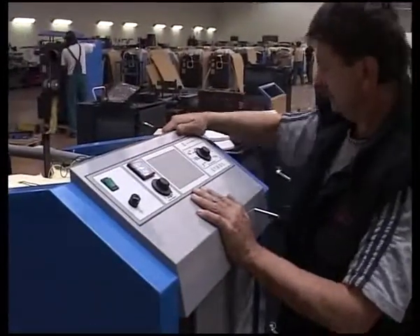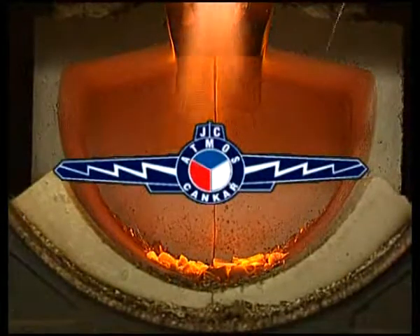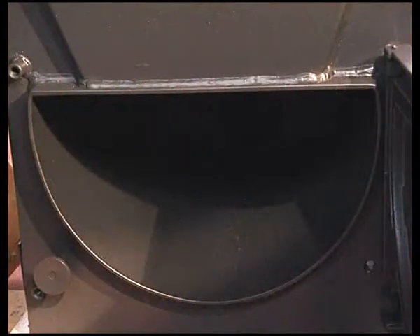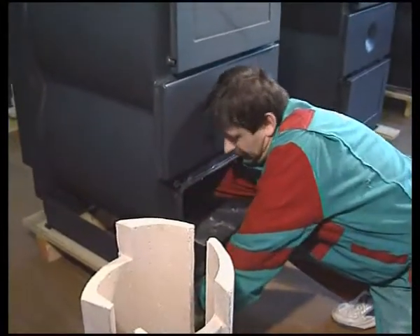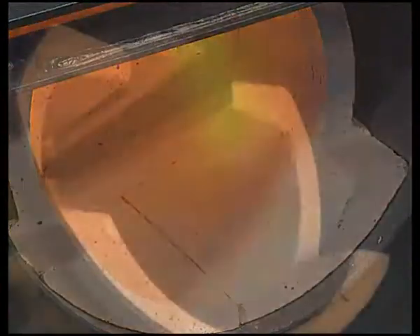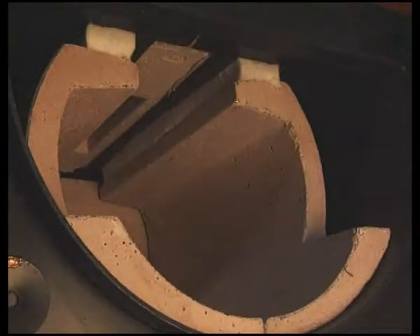The assembly is finished by reinstalling the panels. Replacement of ceramic shaped pieces of the bottom fire chamber is very simple. Before installing new shaped pieces, thoroughly clean the complete fire chamber so that the shaped pieces fit correctly. First install the rear face of the spherical area, taking care for correct orientation. Then install the left and right side, making sure that both shaped pieces are installed evenly and that they have good contact with the boiler body. Additionally, on wood gasification boilers, install several sealing strips between the bottom spherical area and the nozzle bracket on both sides.